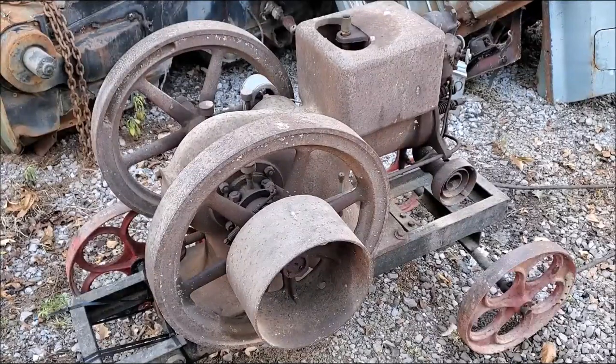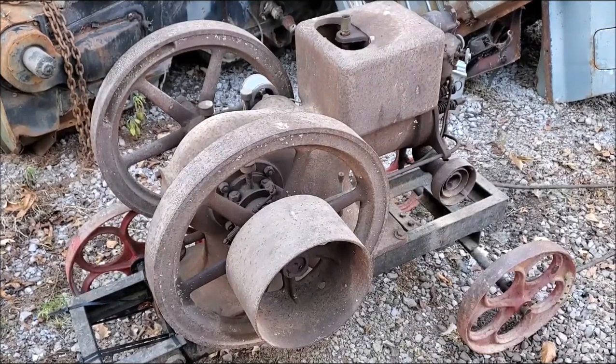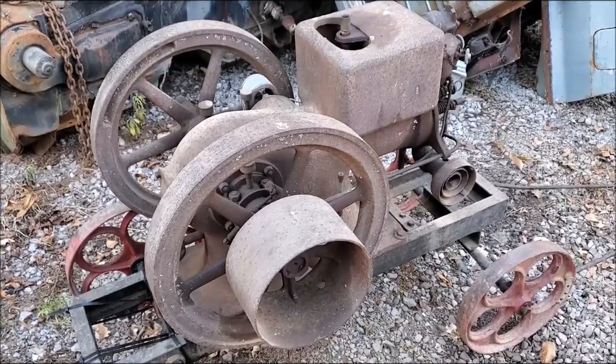As I was pondering the build sheet on this engine, knowing that the engine is stuck, flywheels won't turn. Seems to be stuck fast somewhere. Piston or bearings could be the one. At this point, do you proceed any further than to remove the head? Just asking. You know, you gotta know what it looks like in there.